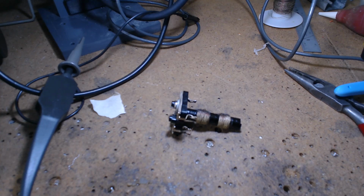And I really like the radios. I really like the circuitry. And when I saw that mystery circuit, which, by the way, I don't think was built by the guy that owned the radio. It's too neatly built compared to the bodge that he did in the radio. He's got tape. He's got wires cut. He's got the soldering iron, I think he didn't use flux core, rosin core. I think he used regular acid core in the radio. It's just, the more you look at the radio, the more I think I should carry it out to the garbage. That's where I'm at, you know.